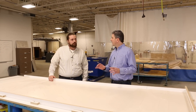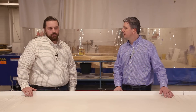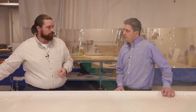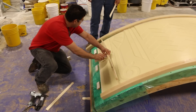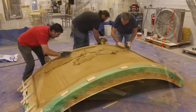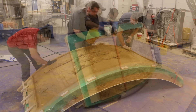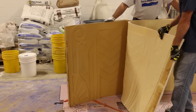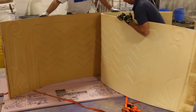That's nice because you were able to use the same form liner but do two separate castings. How did you account for the difference in size? We preplanned it - when you see the original model, you'll see there's like seven or eight inches of extra space where there's no specific detail. That gave us room on the form liner to section that area off, and then we just didn't spray concrete on it. So we were able to use the same form liner to make both size panels, just flipping over that casting bed to make the other opposite curve.